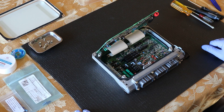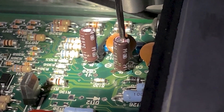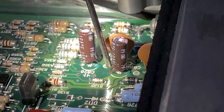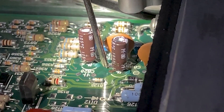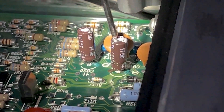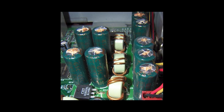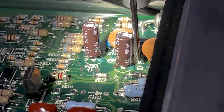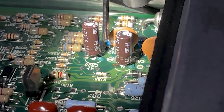Now we can go ahead and inspect our circuit boards and identify the leaking capacitors. If you look at this capacitor right here — at its little legs on the left one — you see how it's brown and kind of looks rusted. That's an indication that it leaked. Sometimes they blow up and you'll see kind of a plus sign where it opened up. Essentially they just leak, they just get old. There are also different signs — it could look like hot glue or it could just look distorted.